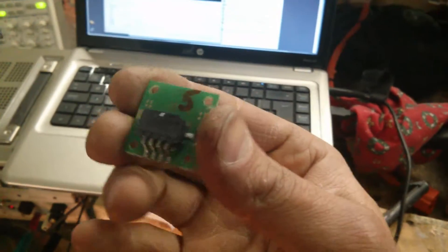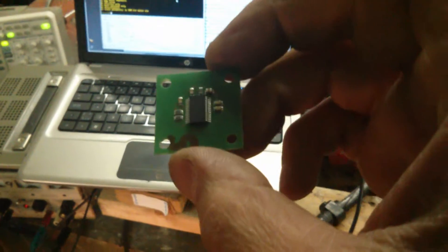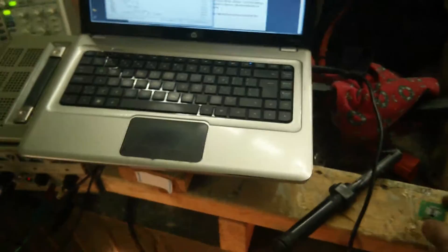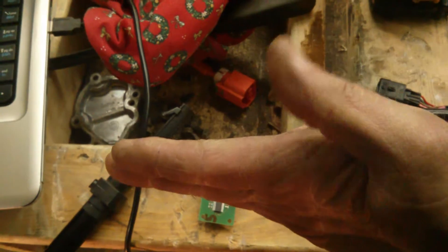It's a pretty simple sensor. It just looks like this. You can see there's a Molex micro-fit plug that goes on there, and then just a little chip on the back and basically a magnet with the polarity north and south. Imagine a line through the middle, north and south that way, and it spins like this, and the chip senses it as it spins up beside it there.